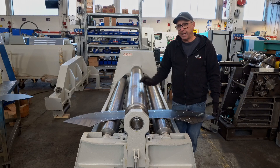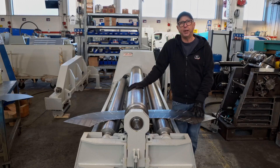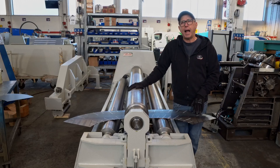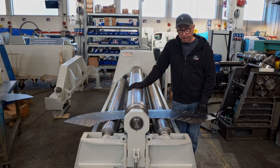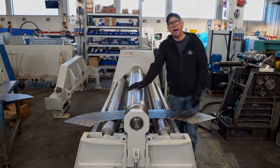You may or may not need to put some amount of tilt in the side rolls when you're doing these. If you find that the large diameter is closing too much and the small diameter is not closing enough, you can add a little bit of inclination to the side rolls to help get the small diameter closed. So we're going to go ahead, do a pre-bend on both sides, and then work sections to our layout line.